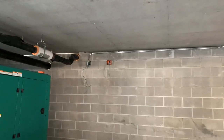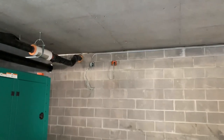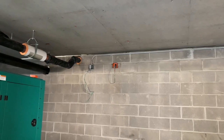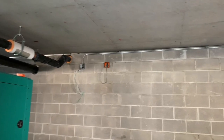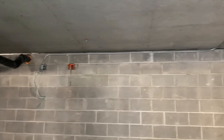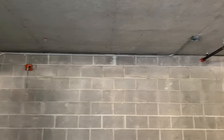After that I was helping my co-worker pipe this over here, kind of just laying it out. He was working on mounting the four-square box, the extension — silver and orange — one on the ceiling, then piping out with a 90 and going into the box on the ceiling.